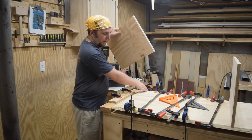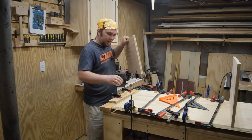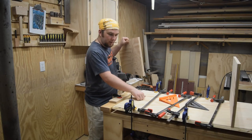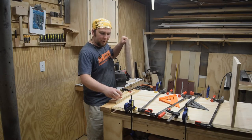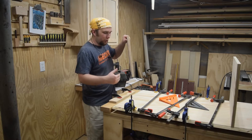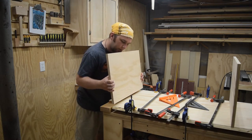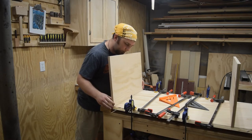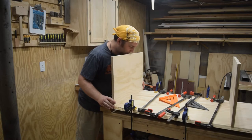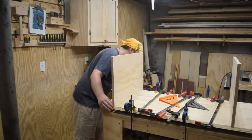I'm going to use a bar clamp at either end, but for the middle I want to push it up, so I've got the back clamped down to the work table. I've got these blocks clamped down to the work table and then I'm going to use wedges to push the only thing that is not clamped down, which is this shelf. So if you'll excuse me, I'm going to change my focus over to gluing and I'll catch up with you after this.